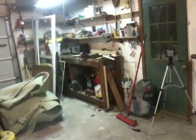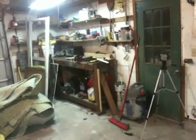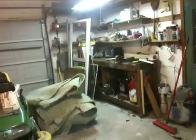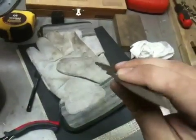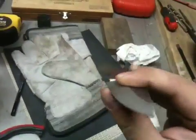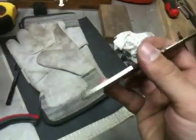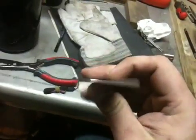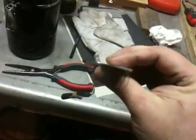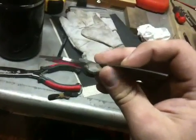Then I'll put it in the tempering oven at the required temperature for the required time, and when that's finished I will simply let the blade cool to room temperature by itself without quenching it or cooling it by force. As far as specifics, when doing the blade grind you really want to leave a little bit of thickness at the very edge — you definitely don't want to sharpen it yet. Don't make it too thin relative to the original stock thickness, because if it gets too thin it could warp, twist, or crack during the quench. It seems to stay straighter if you leave it about the thickness of a dime, if not a little bit thinner.